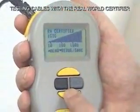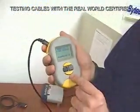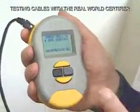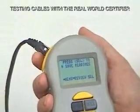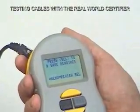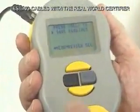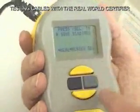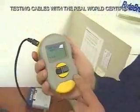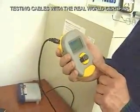Now we can save the results — this is your second chance to save. We bypassed the first chance after level one because we didn't want to stop testing, and now we get our second chance at the end of level two. We can save up to 250 readings and print them out later. Or in a marginal situation, you may want to talk to your supervisor on the other side of the building. After pressing select to save, that was reading number nine — nine tests stored in memory. You can even disconnect the battery and the readings will still be there, stored in flash memory.